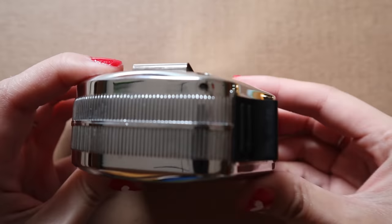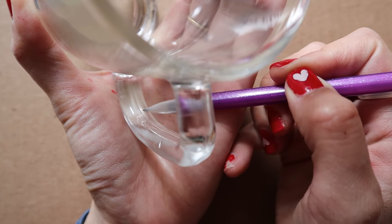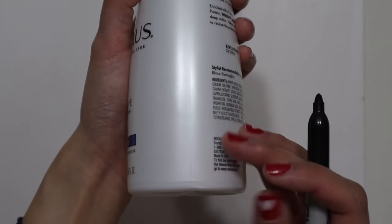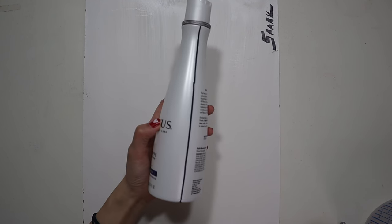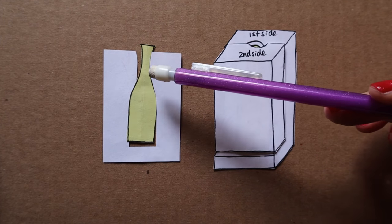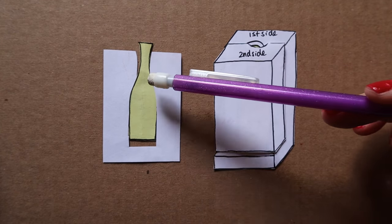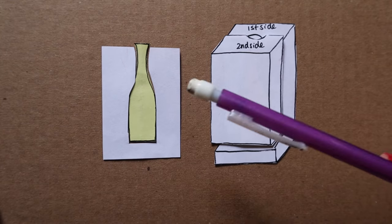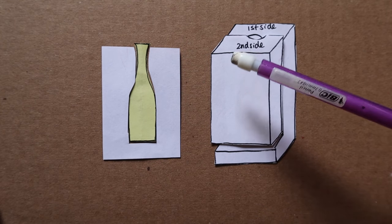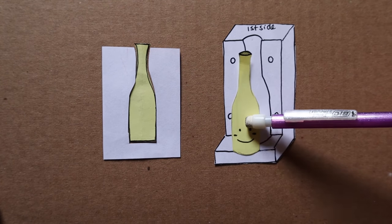You can find seams in everyday things. You can even see the seam in the inner handle of this cup. In most plastic bottles, you'll be able to see the seam line. The reason why I mark up my seams is so that you'll be able to see it clearly. The shampoo bottle I will cast today had outward slopes that'll prevent me from freeing up the bottle as a one-part mold, so the plan is to cast a multiple-part mold. To free this particular bottle, I will be removing the second side in this direction and releasing the bottle the same way.